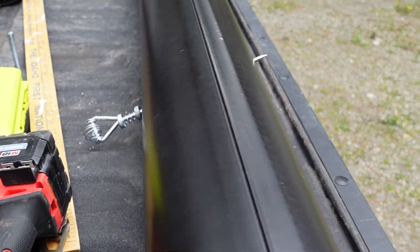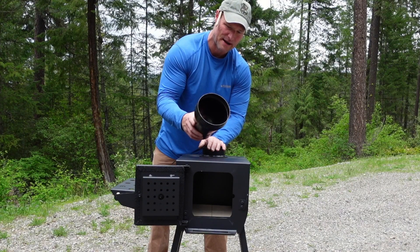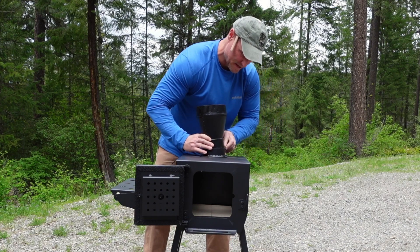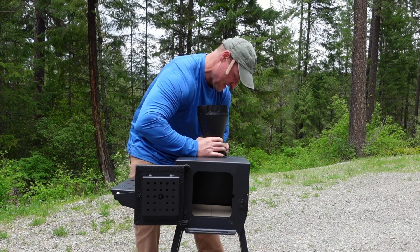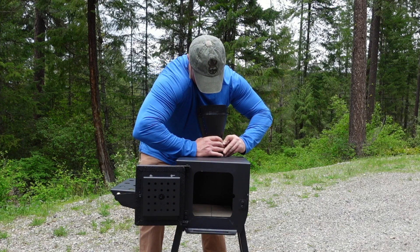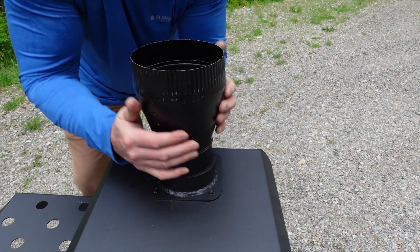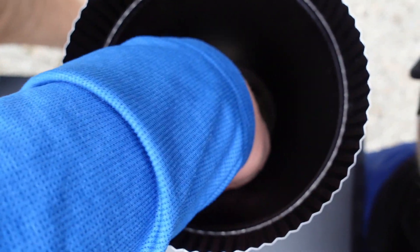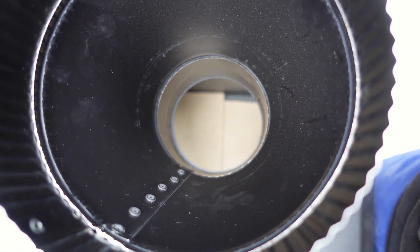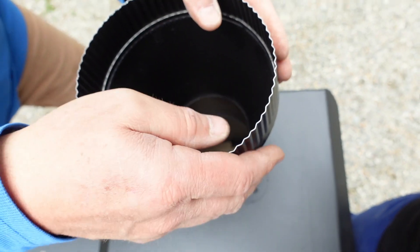Now I've got to mount this onto the increaser - going from four inches up to six-inch pipe. I want a snug fit, and it's almost ready to go if I can line it up right. There's one crimp spot that's the challenge - there's a bevel on the inside of the collar that sticks out, perfectly round, so you've got to get that sheet metal to skip over that raised edge and seat snugly.